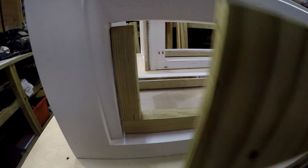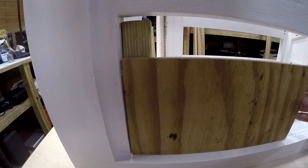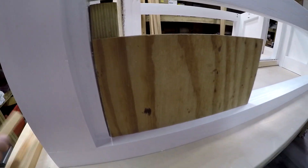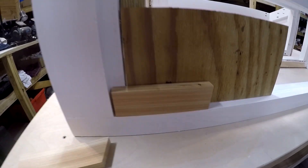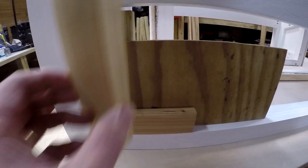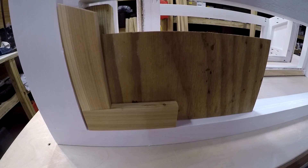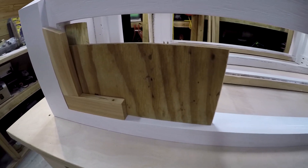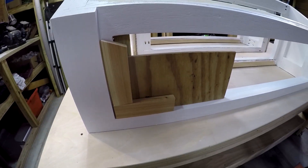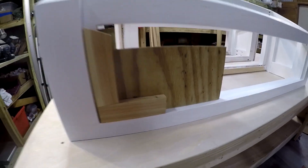And then I've got to sheet that out - you've got to sheet plywood on that. Then come in with the trim, like that, and have a pretty big gap here too. So that's a lot - that's all in the door. But it matches the exact same layers that are in the frame here, so what you'll see is just this outside look, and it'll look just like this.